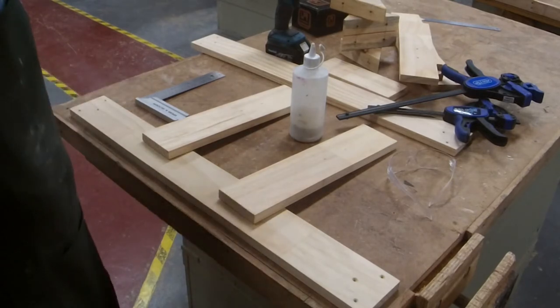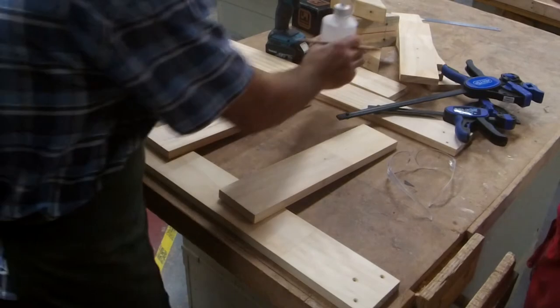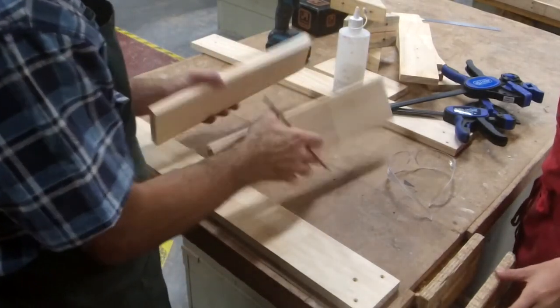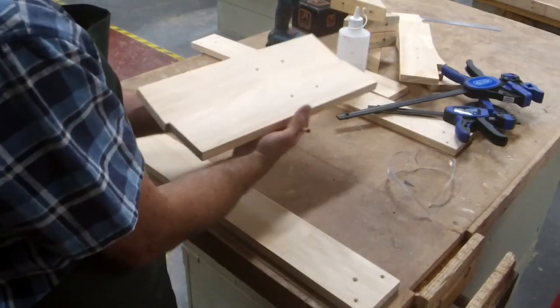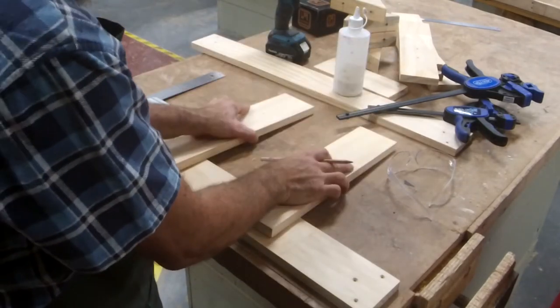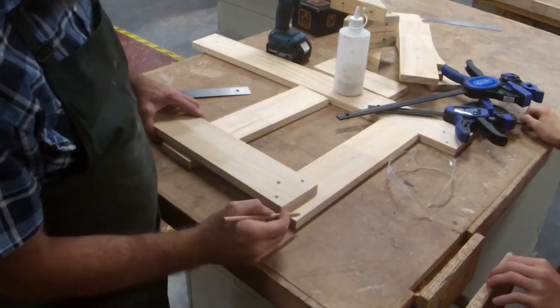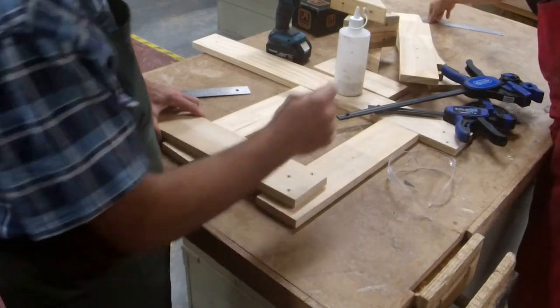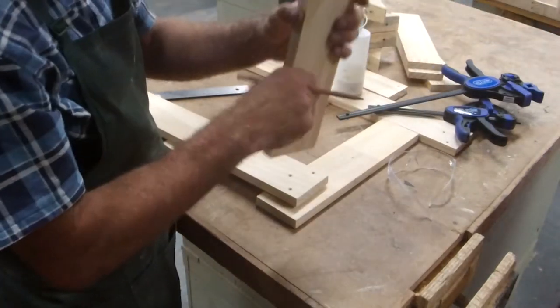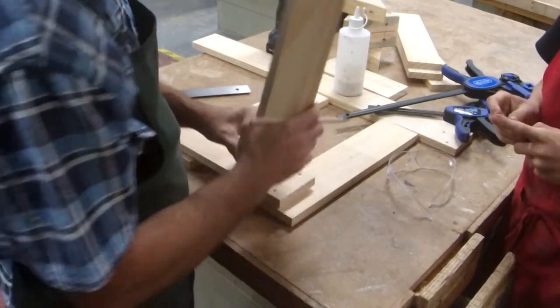Yep, sweet. All right, let's get into it. Make sure your two legs, your two countersunk holes, are at the bottom. So, that's my pair for this table. We need our rails to sit 25 mil from the outside edge. It has to be 25 because that gives me room for our side rails, and we have a little bit of an indent.